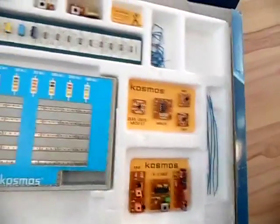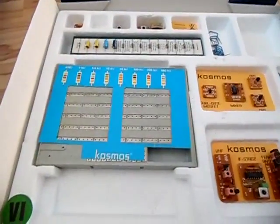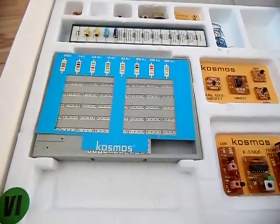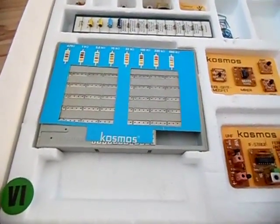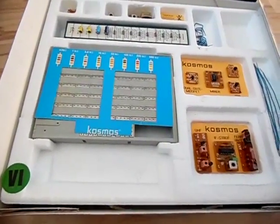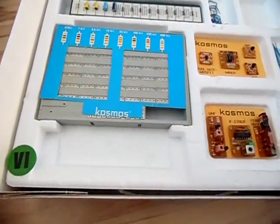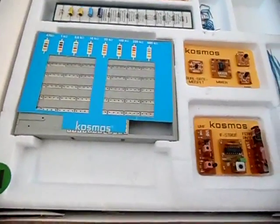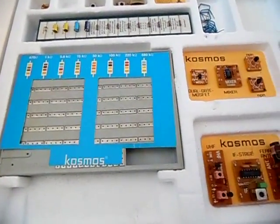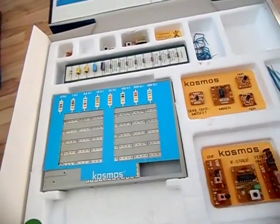I really love this kit — it's been a big part of my childhood. You can build a medium wave transmitter, and the manual says don't add a long antenna. Of course, what did I do? I added a two-meter wire antenna. That became my first broadcast station: a small radio setup in my room with a CD player, cassette player, and a mixer for the microphone, transmitting on 558 kHz. The range? About two to three meters, maybe ten feet — but that was broadcasting, and I was completely hooked.